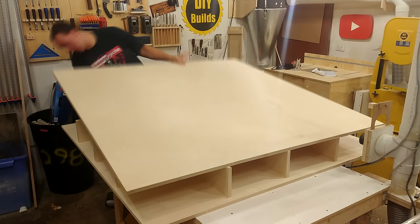I drove in only one screw on each end to act as a pivot point, so I can twist and change the direction of the Z axis checking with a square against the table. After everything measured up square, I drove in all the screws on each end.